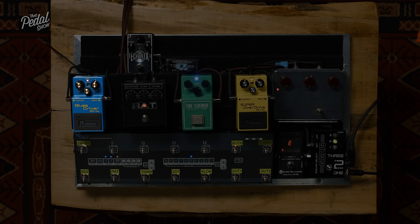So, why is that important? If you think about the way that we are creating the distortion with those symmetrical hard clipping diodes, what's important about the headroom in that stage is that every detail of those germanium diodes is coming through. No part of that is getting lost in a slow slew rate of that op amp.